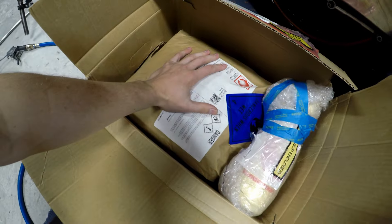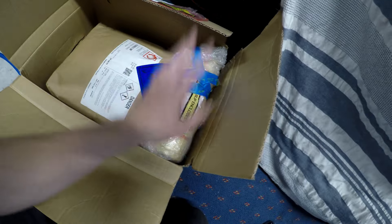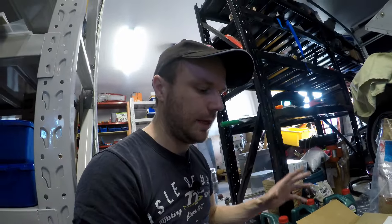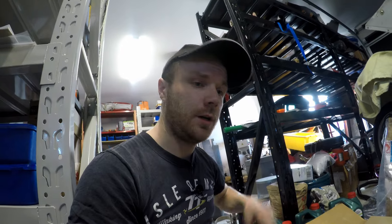The other two additives I've got for the casting are flux, which makes the aluminium a bit more liquidy and easier to go into the mould, and degassing tablets, which remove the hydrogen that the aluminium absorbs when it's molten. Now one thing on my mind — all these new things have nice big warning labels with detailed descriptions of all the chemicals and the ways they can try to kill me. So I've got to be careful and take extra precautions.